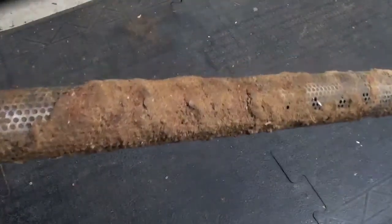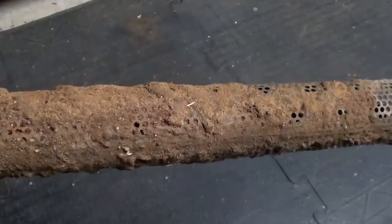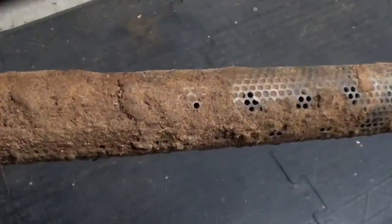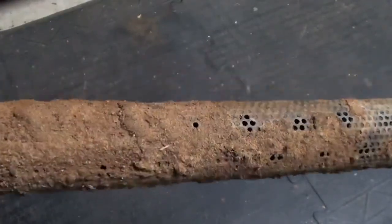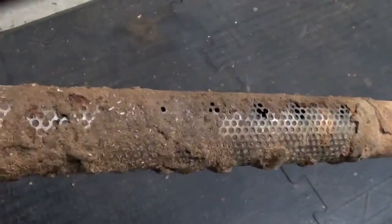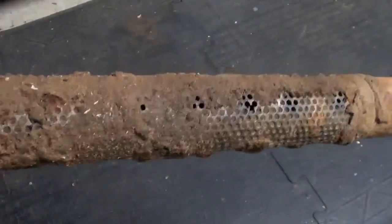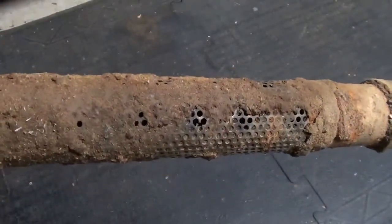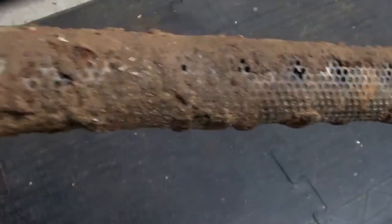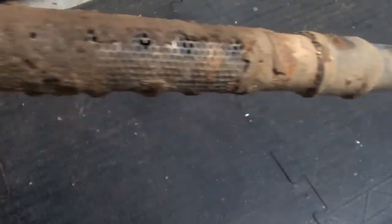This is probably a 50-year-old well-point. First thing I observe is these holes are fairly large, and there's a couple that are cracked. But I think for the most part it's just that it had been packed with sediment. Even where you see it's open there, I knocked that out. This was totally packed with sediment at the bottom, all the way up to the top.